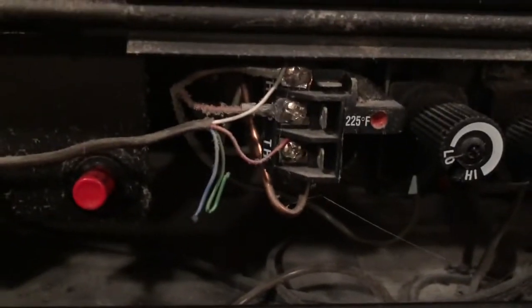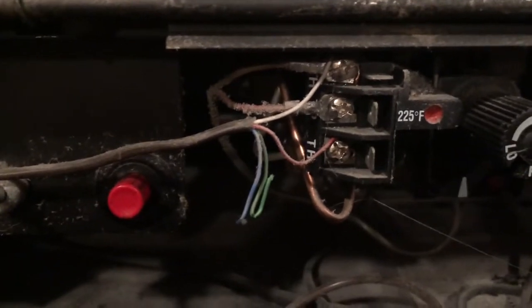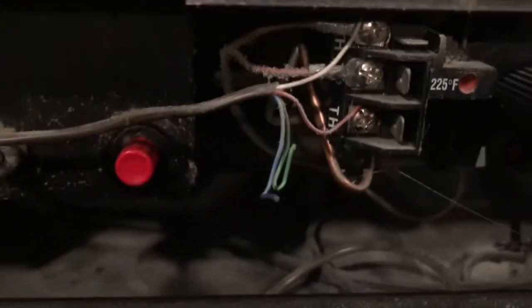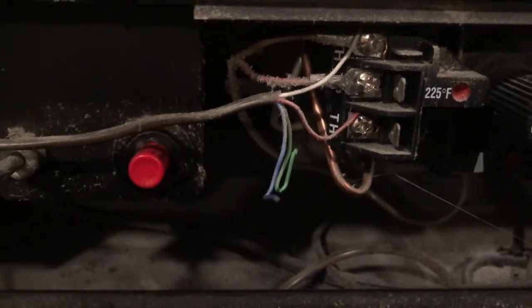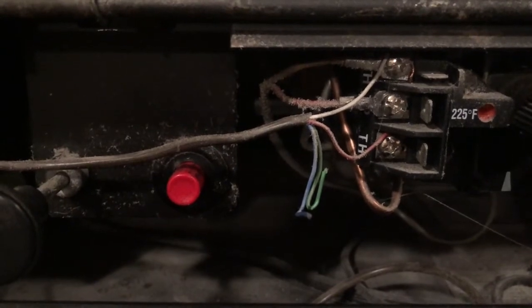Okay, this is what mine looks like in here — obviously not like a typical HVAC system. I have two wires; this is the wire that goes to my thermostat. I have the two wires that are plugged in here, and then I have two spare wires. These two spare wires are going to be the ones that I splice into my 24 volt adapter.